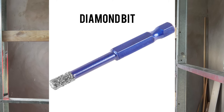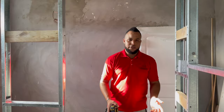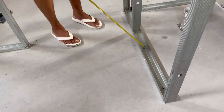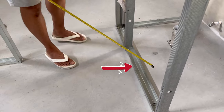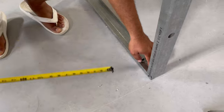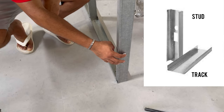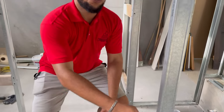You need a diamond bit to drill the hole into the tile to affix the screws. The difference between a track and a stud is that the stud fits inside of the track. So typically the track sits on the floor or on the ceiling. The stud is a little bit narrower so it fits inside of the track. Most of them side-by-side, an easy way to differentiate is that studs typically have a hole in them and the holes are for running cables or utility wires.